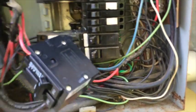And I just mentioned to the customer that that same bus connection, you see the section on those two single poles, it has a burn section on it. So I told him that he may have some problems with that as well. So we need to go ahead and address that soon. I'm not an electrician. I do heat and air conditioning, but I do know what I see. And that's all the same thing with this one. So this was already having a problem, more than likely. It just wasn't detected at the time.